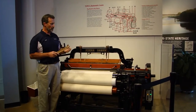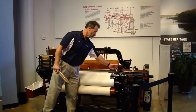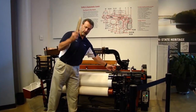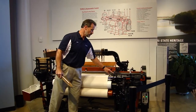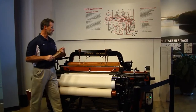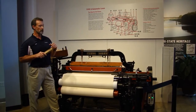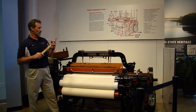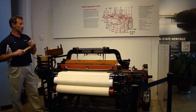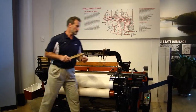There are other poka-yokes I'd like to point out. One checks the weft yarn to make sure it's present. There is a fork that moves every time the weave moves forward, checking for this weft yarn. If it's not present, there is a latch and the machine automatically stops. Behind the heald system are four rows of stainless steel droppers — again, to stop the machine if something's abnormal. If only one of those 3,200 strands of yarn should break, those strips will fall and hit a very sensitive rod that triggers a latch and stops the machine.